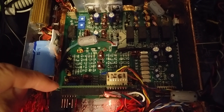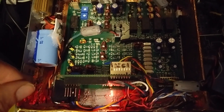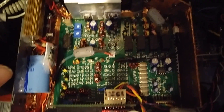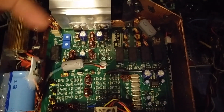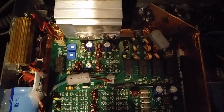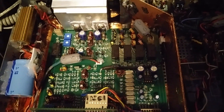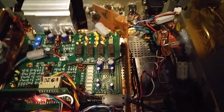I don't use the Arduino 5 volts because I find that even with a heat sink — which I've added — it just runs too hot. Just add another little regulator on the side and you're good to go. I've added toroids here to keep things really quiet. The screen's great — it doesn't give any noise at all, very quiet. There's also an extra heat sink and a fan at the back because I run FT8 and want to do digital modes as well. A little bit of shielding between the audio — lots of overkill.